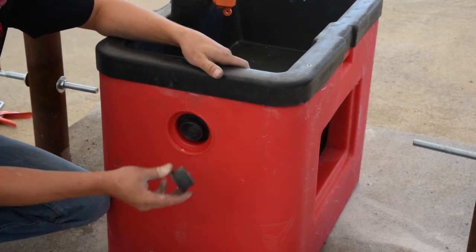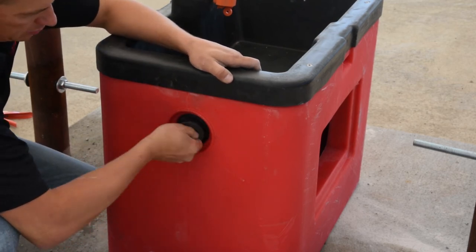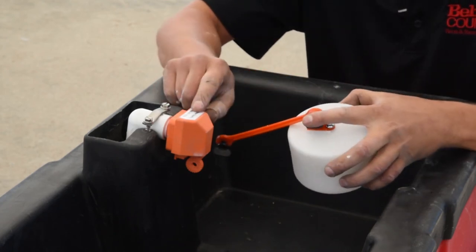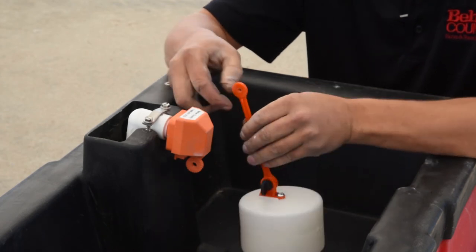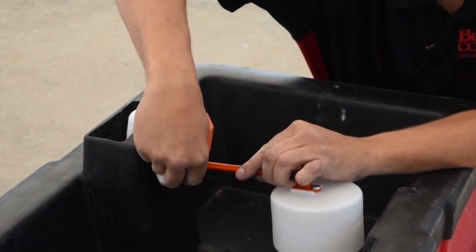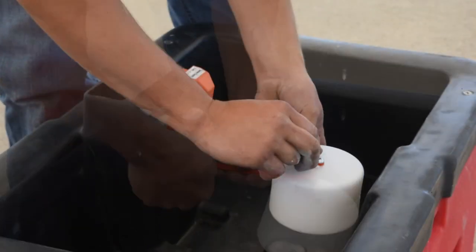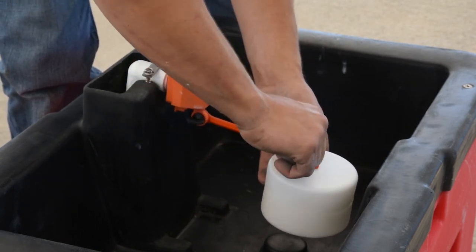This unit is a little different than most of our drinkers — your drain plug gets installed from the outside instead of the inside. Tighten your wing nut down and you have a good secure fit. Our next step is to install the float onto the valve itself. The float just uses a plastic wing nut. You'll see one side has large cogs, the other side has small — you want to match that up with the float arm on the small cogs on both sides. That's what allows your adjustment. Also adjust the float side so that it doesn't hit the side of the basin.